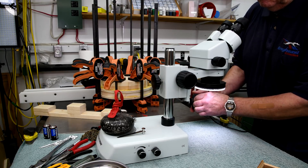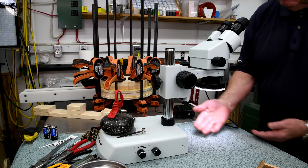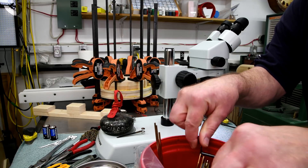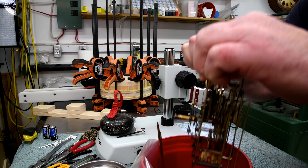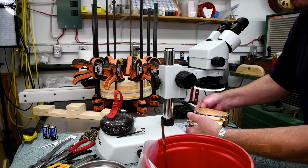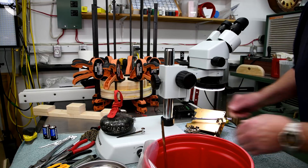When uncle Jake brought his clock over the other day, he told me that the bearings were getting elongated - or he had been told that the bearings were being elongated by the shafts. I knew exactly what he was talking about. As the shaft turns it sort of wears a groove. What you're looking at here is a drawing of the back of the movement - the back plate - where it says 'made in Germany' on the bottom, even though the clock was made in Holland. So you've got the shaft holes.